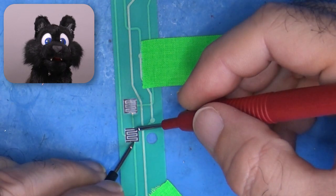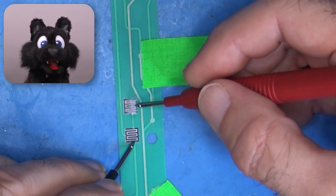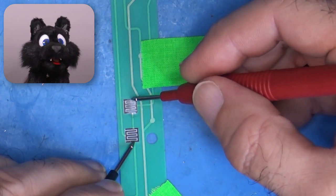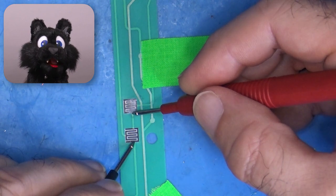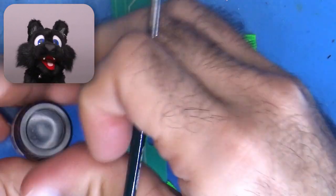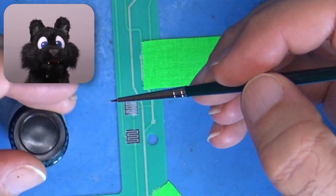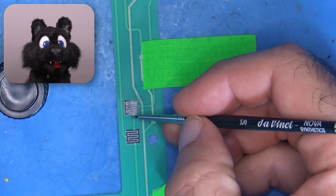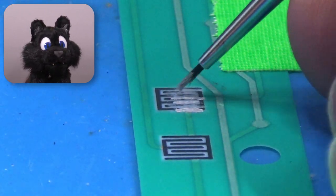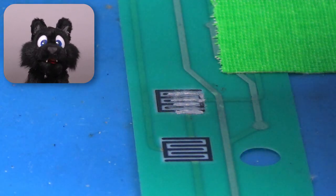The buttons on the front panel were obviously missing for some time. One is the off button, and it seems that somebody has used a screwdriver or similar implement to bridge out the contacts on the flex PCB for some time. Those are completely broken. I have some silver conductive paint from another project left, so here goes. Painting tracks back on the PCB, making sure that they are conducting but not bridging out the two traces.